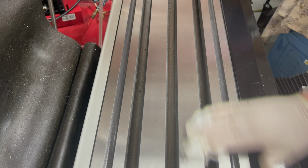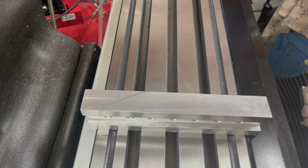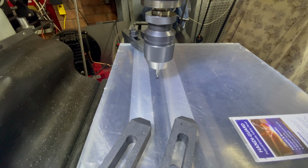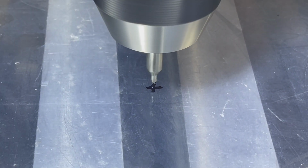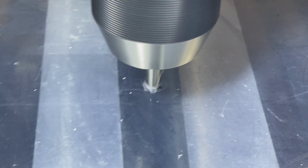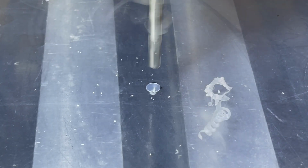I was planning to drill and tap this hole in the drill press, but since this is polycarbonate and prone to chipping, I'll set it up on the mill table on a pair of large aluminium parallels, which I'll set close together to provide the support needed for the sheet. After using a centre drill, I'll tighten the camera mount before running a pilot hole and finishing with a 14.5 drill.